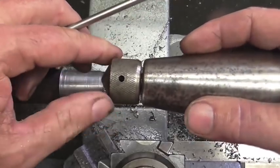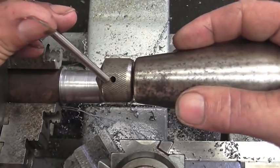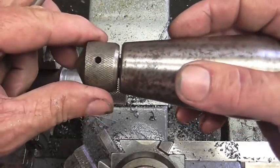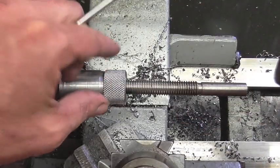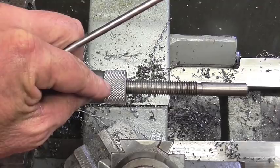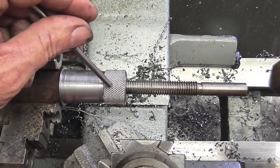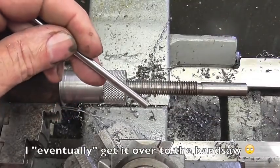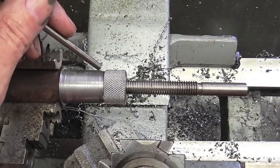I kind of like the idea of having this hole here so that if you need to insert a steel rod or something to go ahead and tighten this guy up. I've never used one of these, but it seems like a good idea. So before I lop this thing off, we're going to take it over to the mill and pop a 204 thousandths hole. I've got this 3/16ths steel rod here and we'll use that to go ahead and tighten the jack up.